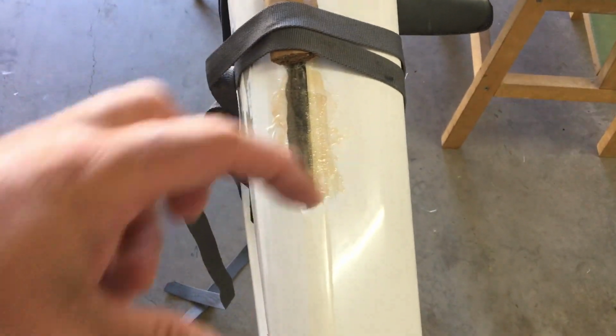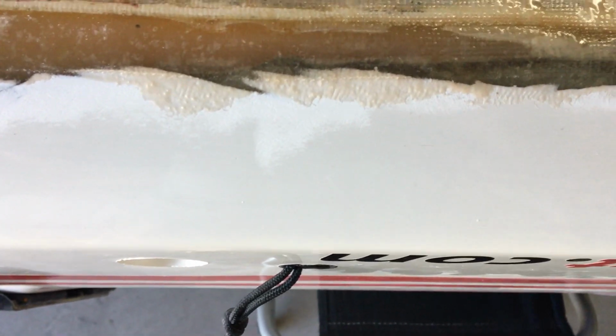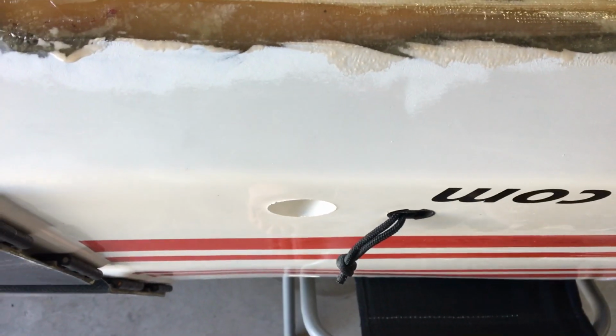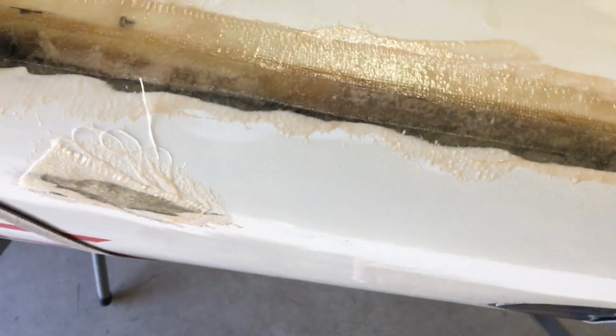So I just cut some of that, I think I got 75 mil, just cut it down. You'll see there's little straggly bits, I'll just sand off at the end. But the idea is that you want to put down some resin first and lay your cloth, dab the cloth in so you get all the air out of it, and then the roller at the end rolls any little air bubbles out. I'm not too worried about these little straggly bits, because that'll just sand out once we go flush. So I figured that'll set, and help hold it clamped while it sets.